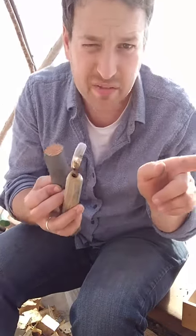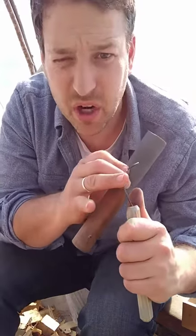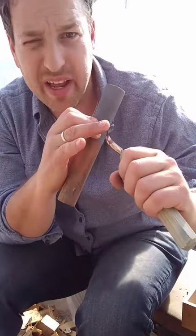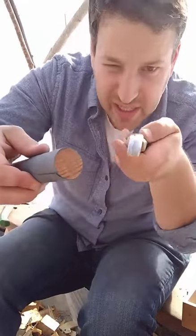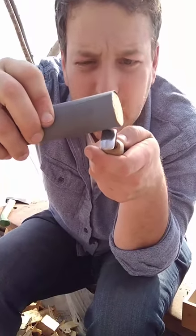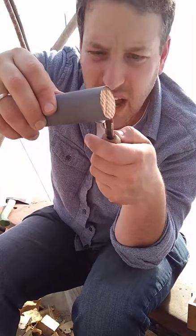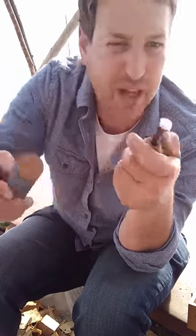Because I've been pushing away from the edge, depending on how much sharpening I've done, there could be a little wire edge right on this edge here. What I do is sight down it to see where that little secondary bevel is and just knock it off — I don't have to do more than that. Some people sharpen by pulling away — everybody has their own systems. This is how I do it because it's what makes sense intuitively to me and it's easy to do in my lap. But really, the only thing that matters is: is it sharp? If it's sharp, that means the edge geometry is doing what you think it's doing, and nothing else really matters.